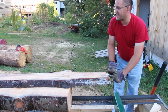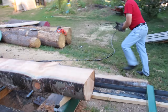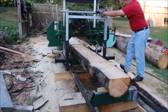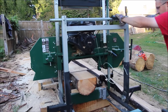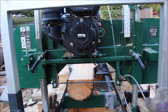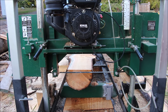I'm going to see if I can get five inches out of this, but in order to do that I have to save this piece for later. I usually run the mill on its way back to get all the sawdust off — it clears it off. If I'm not going through bark I use the regular lubrication system, but if I am going through bark then the hose is definitely the best.